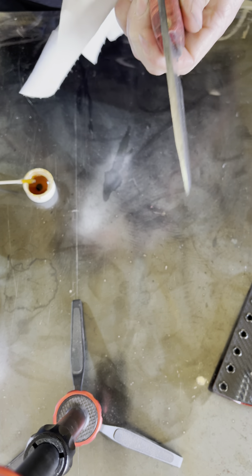So I'm gonna be mindful of that. Now, unlike a lot of acids, ferric's not quite as dangerous if you get it on your fingers or whatever. It wouldn't be like a hydrochloric-type stuff — it doesn't react the same to human skin, or not that I've found. But typically if I do get it on me, I'll just spray my hand with some Windex and wipe it off good and I don't have any issues. Just a little FYI on the ferric chloride.